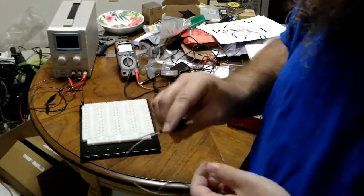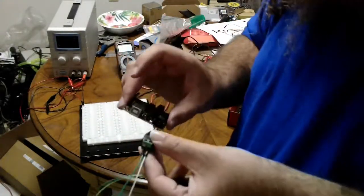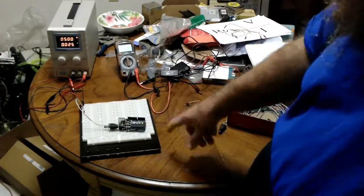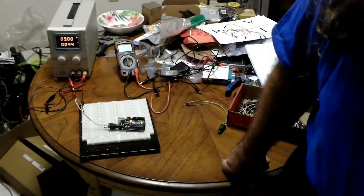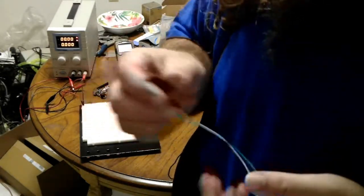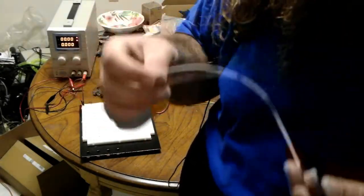The purpose of this, for example: I have a power supply plugged into my breadboard, and I want to power an Arduino with a barrel jack. So I plug the male end into the Arduino, put the positive wire into positive power and negative into negative. With five volts and the current turned up to an amp, the Arduino turns on drawing 25 milliamps. The Arduino actually wants more than five volts — it recommends nine — so at nine volts it draws 44 to 50 milliamps, which is about right. This is for hobbyist or prototyping purposes where you're designing the device and testing out different power supplies.